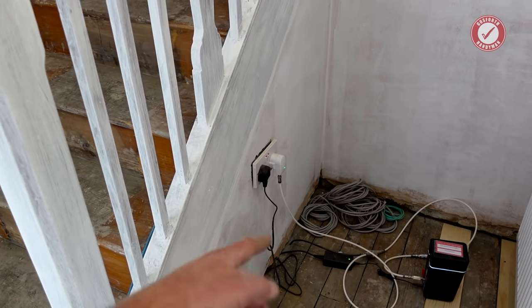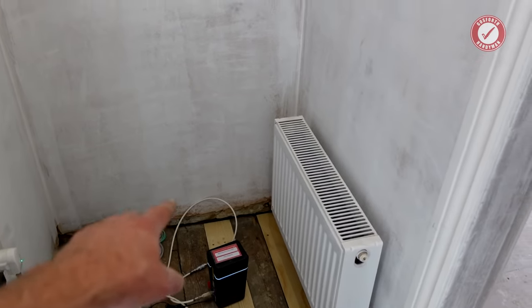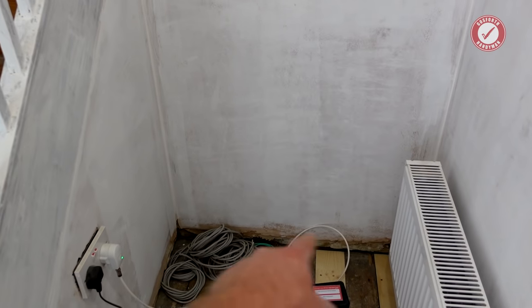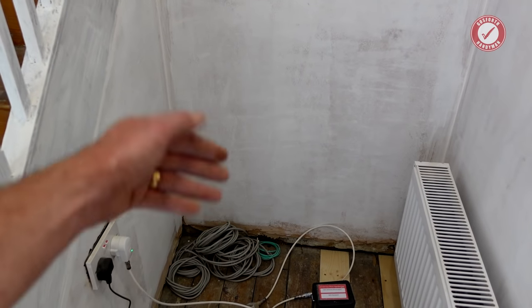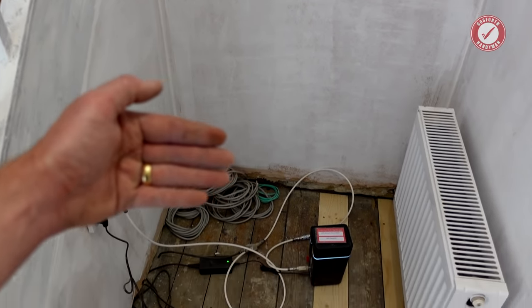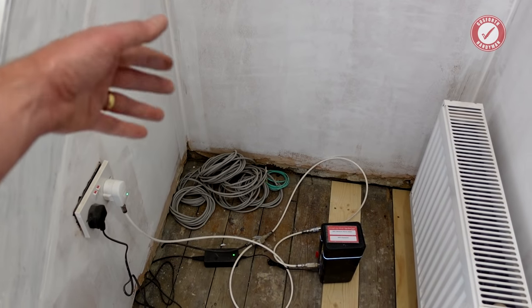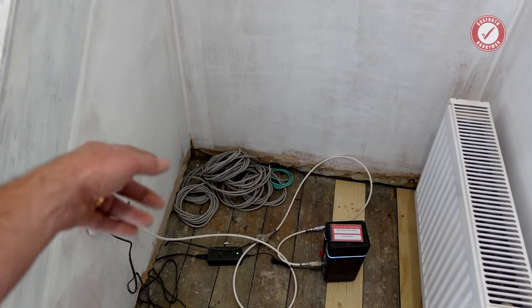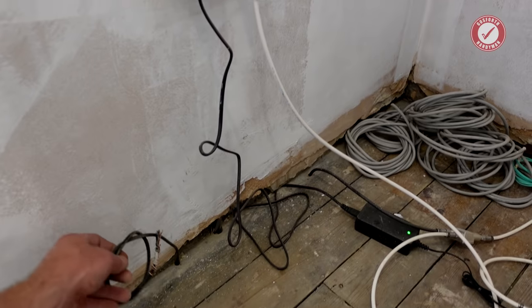Over on this side, the quick win is going to be the back side here, because then we'll push up the scribe joint on the left and we'll push up the scribe joint on the right, but the back will just be a butt joint on either side, a square cut on either side. But I am going to bring it out a little bit, because there's going to be a router down here, and a little comms area, where the fiber comes up. Over here we're going to have at least 2 cables that need to come through.